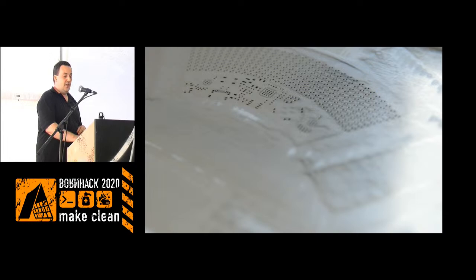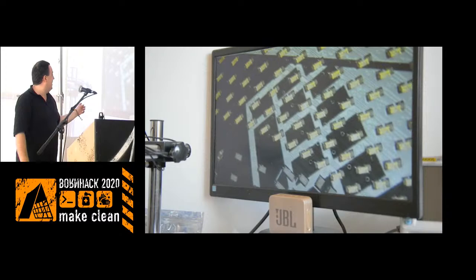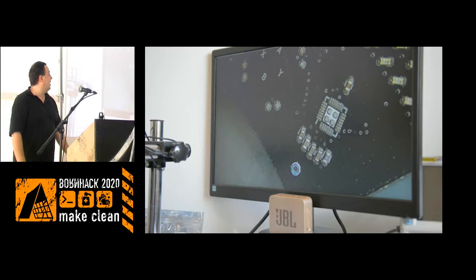Another issue is that some of the LEDs, like the one in the corner up here, the machine put on its side, so it doesn't really shine up. I think we caught most of them, but there might be a few that we've missed. But this manual step of looking through a microscope and checking all the parts that are on there, and then adding the leftover parts, like connectors and the controllers, they're all placed by hand by me and my friend. So it was a tedious job, and it ended up taking at least 2 days and most of the nights also.